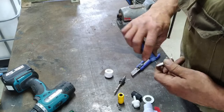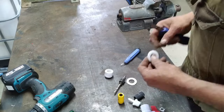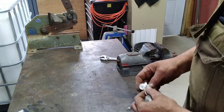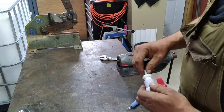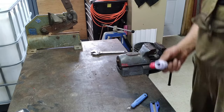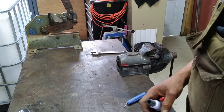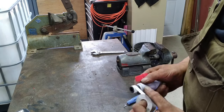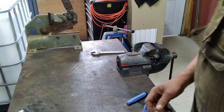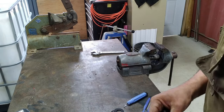There should be something where the gas can come out of the digester, so that's what these parts are for. A little standard Teflon tape, hose connector, elbow, a couple of fittings, and finish with the gas outlet. And don't forget the rubber gaskets and the O-rings.